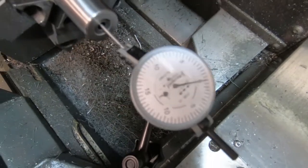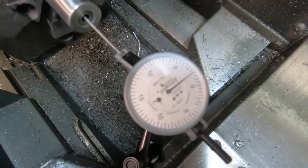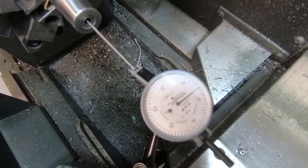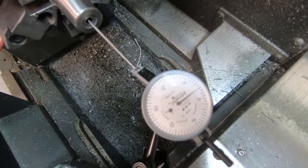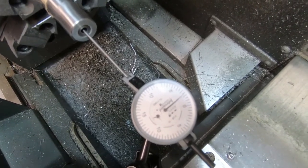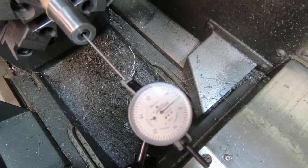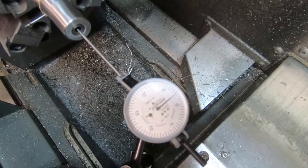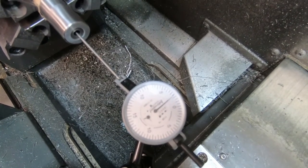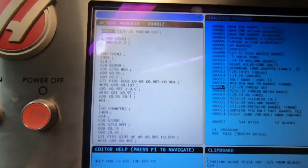You can put this indicator anywhere within that last section of the barrel and it's reading pretty much dead on zero. When the bullet leaves the barrel, everything is perfectly straight. Some barrels have a little bit of curvature - it's hard to drill a 28-30 inch hole without a little wander - so we just want to make sure the last two to three inches is perfectly square. That way when we put our threads on, the bullet can follow any slight curvature in the bore. Now we'll get this set up, fire up the machine, and cut the threads. I already have the half-28 program pre-loaded.